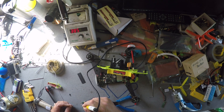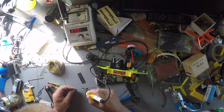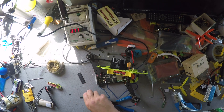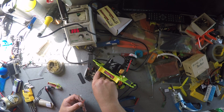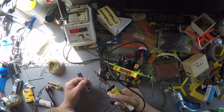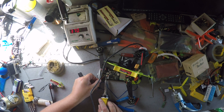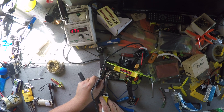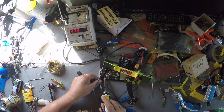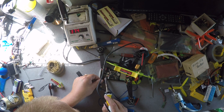That's one, there's two, and that's three — good enough. What I first do is solder it on the PDB so it's on there definitely. First I heat up the solder on the PDB and then I can add the wire to it. There's not much room down here, so be careful — don't hit anything, because the soldering iron is pretty hot and it could melt some of the plastic components down here.